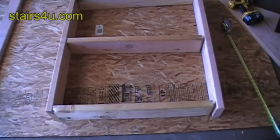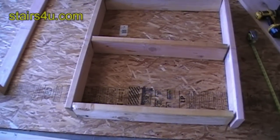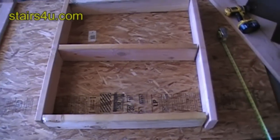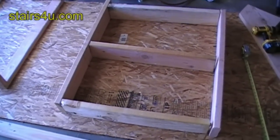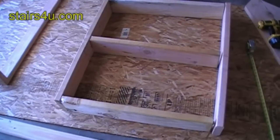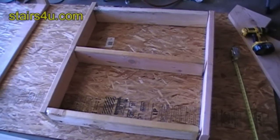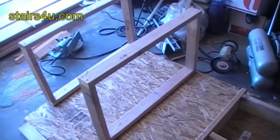It's easy — you can do it either way. I do it both ways. I just wanted to give you an idea with this video of a way you can do this. The same way you can lay out walls, you can use your wall framing tips the same way to frame your floors or even your stair landings. Simply nail this together, set it up on top of the platform, attach it, and you're done.